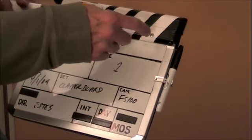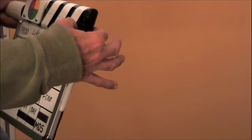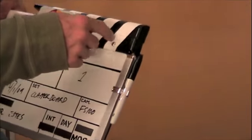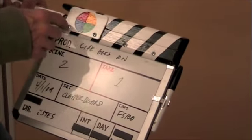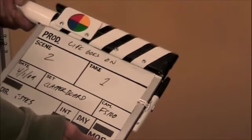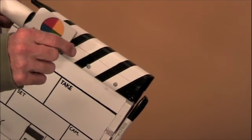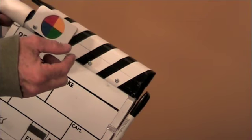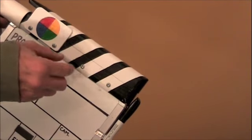Then the board slides right up into that groove. You want to screw it in, so drill your pilot holes — this is about an inch thick, so get maybe three-quarter-inch screws and get that in tight, making sure it's all straight. You can measure on your drill bit and put a piece of tape so you don't drill too far and come out the back.